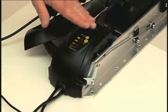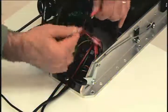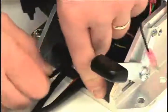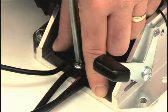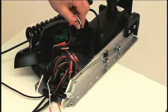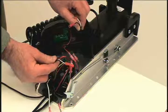Next, we need to remove the center housing — push it on both sides of the housing while lifting up. Locate the connectors on the black and white wires and pull them apart. Using a Phillips screwdriver, loosen the cable strain relief which is secured to the base of the motor. Position the iPilot steering cable into the open slot. Now tighten the steering relief — the cable should slide freely when properly installed. Locate the black and white wires coming through the center housing, then find the black and white wires coming from the iPilot steering cable that we just routed through the steering relief.